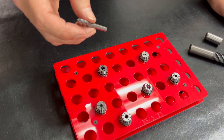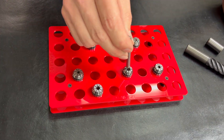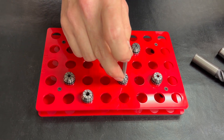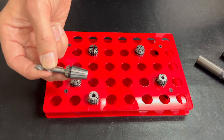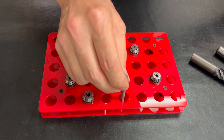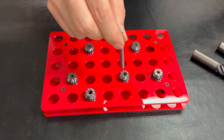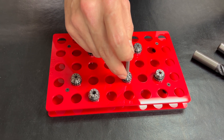There is a range of compression that each collet manufacturer has for each size. But generally, once you're familiar with ER collets, what most people do is find their tool first and then select the collet based on how it feels. The easy way to do that is slide it in while it's in the rack. The benefit of this rack is that you're pushing on the collet against the bottom of the rack, so when you slide it in, the collet size is not affected at all.